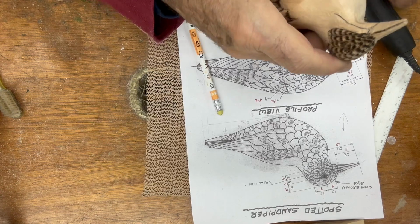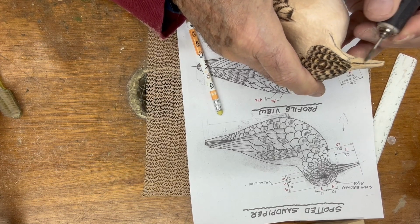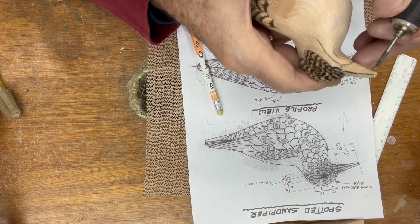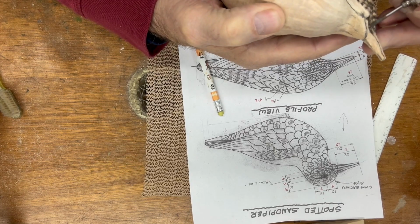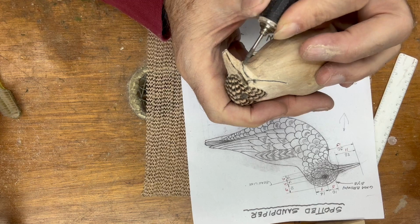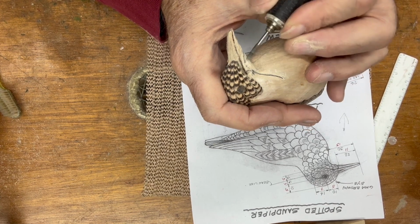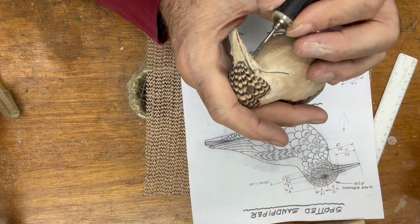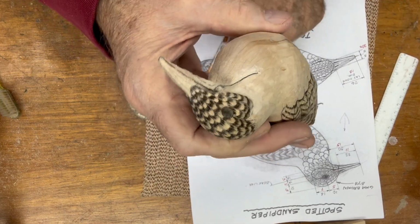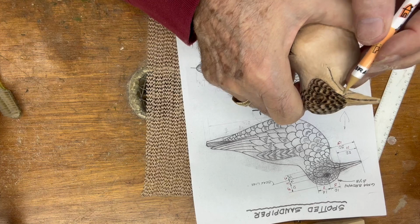All right, now I'm going to flatten from here to here. Get that slope from the burn to the center line. This is still too high up here, so I'm going to fold this back. And you've got to do this slowly and controlled. Okay? Don't be aggressive here at all. Can't be. You're in that much material. So we got the C. We come out, and we come over and around to the other side.